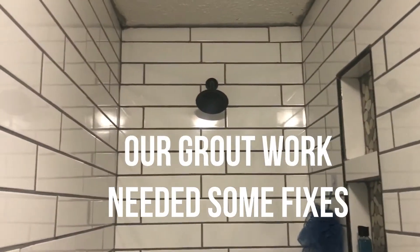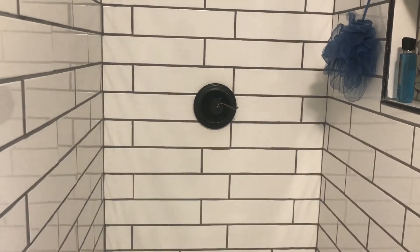So this is the newest shower that we've put in, and Olivia's tried it out, Michael's tried it out — it works beautifully. But in taking some showers in here, we have noticed some cosmetic issues we want to take care of. The grout was too wet, and it made some little air pockets. Once that dried, those air pockets popped. I'm just going to fill those up and patch those. There's another little tiny one. We'll get the shower ready to use fully — it functions.